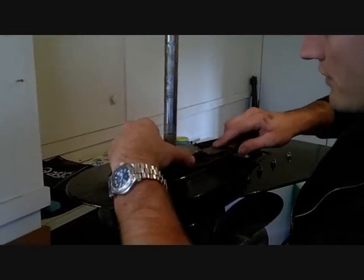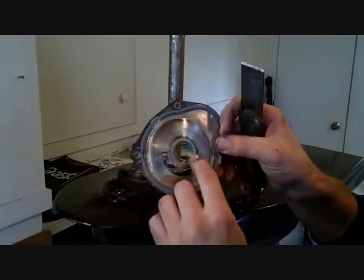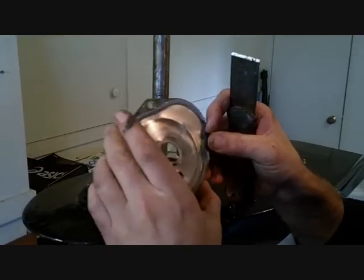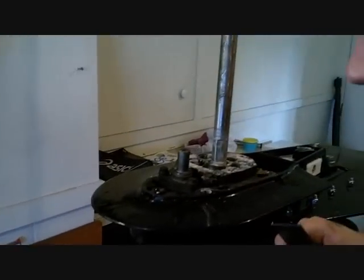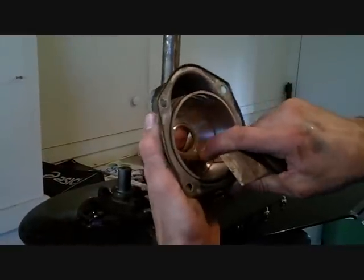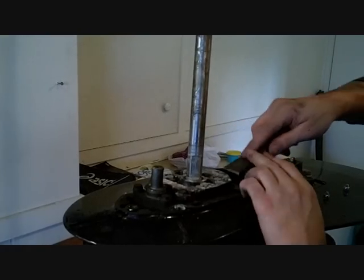Pull the plate off. You can inspect the plate for grooves and wear. If it doesn't have any grooves and wear, if it's nice and smooth, the plate can be used again. Same with the housing itself — if there's no grooves on the inside of it, they can be used again. Clean up the old gasket surface.